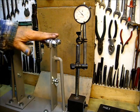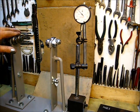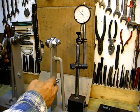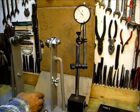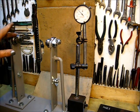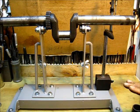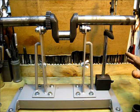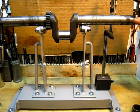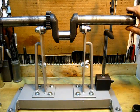This machine will function perfectly for that. It's built specifically to be a crankshaft consistency test machine. These indicators can be mounted anywhere that you need them on this machine — this support can be moved anywhere in the middle. These are a very versatile, necessary tool in a job shop. This is actually the way this machine will be used on a daily basis. I have several crankshafts that were out of the engine — that's the reason for the machine. I could have assembled the engine and then put the dial indicator on it to check the crankshaft, but just a stand-alone crankshaft lets you know if it is straight and true to itself.